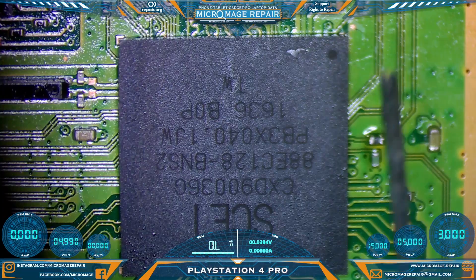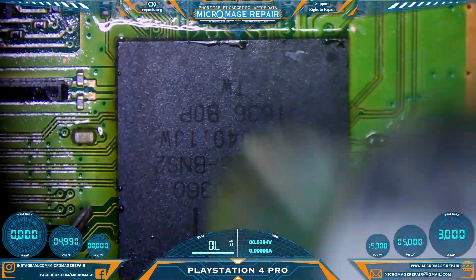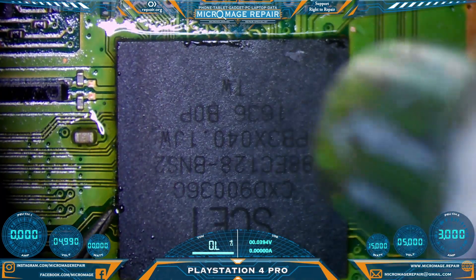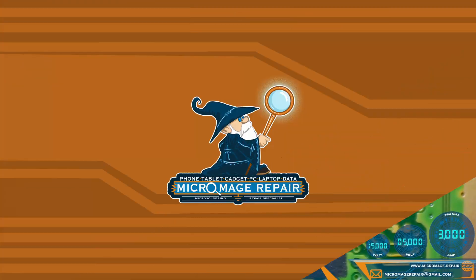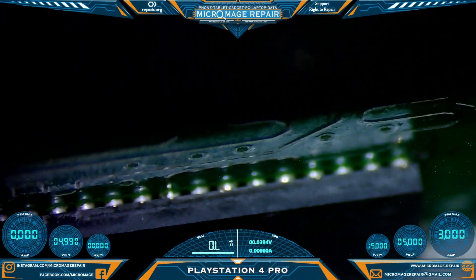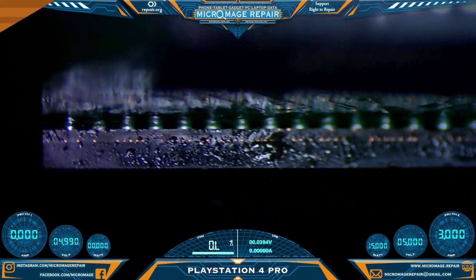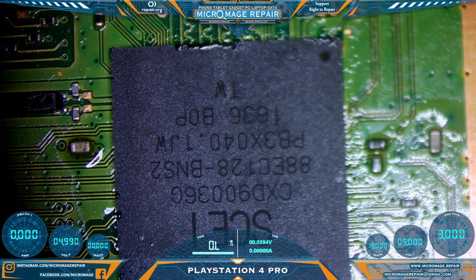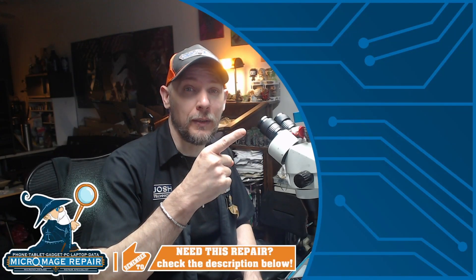Let's add some flux. Now we'll bring the heat — give it a little nudge. That went way faster than I anticipated. Let's take a look and see how we did. That looks pretty good. Excellent. So I'm not going to know if this one is a successful repair until I take it back to the shop and they're able to assemble and do some testing. And this is the preheater I used, the T8280. The repair was successful. If you enjoyed this video, check out that one and I'll see you there.